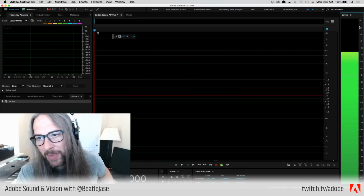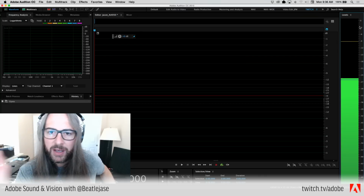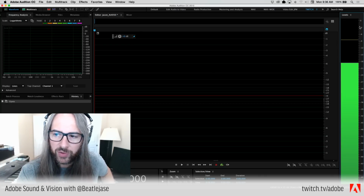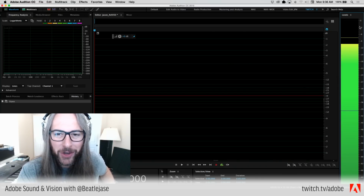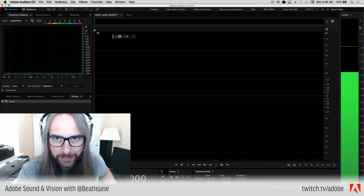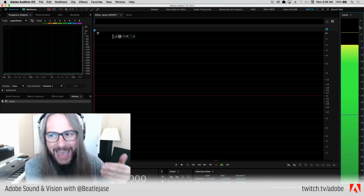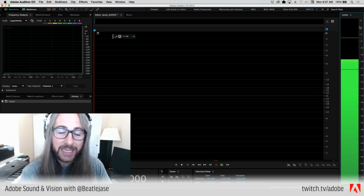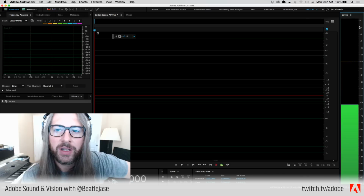Now, this is something that I'm not really going to get too much into here because this doesn't apply to everybody, but the term that I will often drill into new engineers when I'm teaching audio is this concept of gain staging. It's really the microphone into the preamp and getting that level set correctly even before it gets to the sound card, to the application.